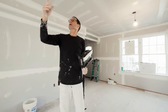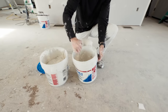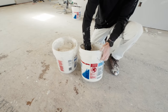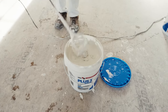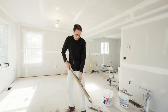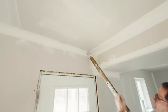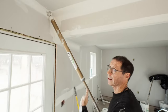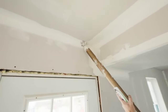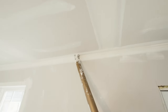Once I do the inside corners, I'm going to get back on my stilts to point it all up, and that's when I'll touch up all the butted seam intersections. I just need to thin the compound down a little more for the inside corners — I want it just a little bit thinner. This is the compound tube; I'm going to fill it with compound. As I'm applying this, if I find I'm using a lot of physical exertion to get the mud out, the mud is too thick. I think that's pretty good — I'm not working that hard and it's coming out nice.